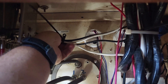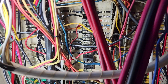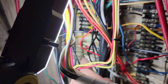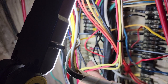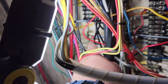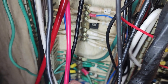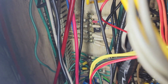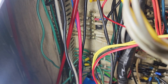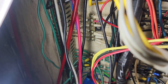Once I determined I actually had an AC leakage problem, I came to the neutrals and disconnected the shore power at the pedestal, just let the cord stay out there. Then I put my multimeter on ohms and read from the neutrals to the grounds, and I had like perfect continuity — which is not what you're supposed to have. It's supposed to be very high — mega ohms — just about open. So I was like, all right, somebody's got some wires crossed.